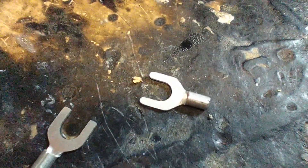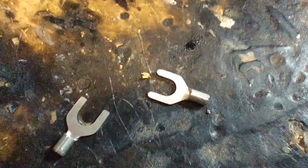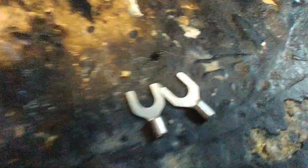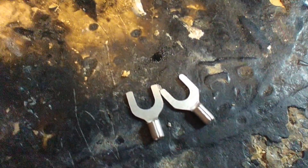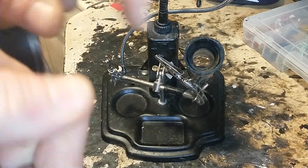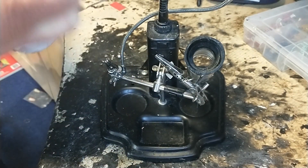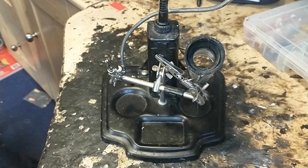In the interest of a little bit of science, and to be honest, me wanting to know what's the best way of doing it, I'm going to do a little experiment. I won't heat shrink, but I'm going to connect two wires onto these — one soldered and crimped, and one just crimped — and we're going to see which breaks first. I'm using the same piece of fairly thin wire and bending it backwards and forwards.